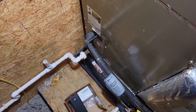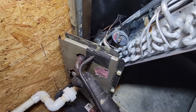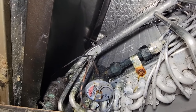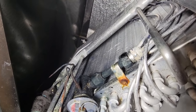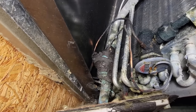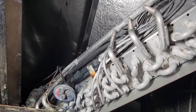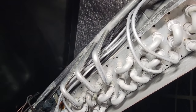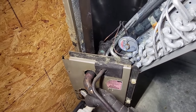They've got a water treatment system that treats it so you can't taste it, but the effects are still there. You can see the TXV is pretty eaten up. Unfortunately they didn't include the coupling piece that goes from the aluminum to the valve — they used a flare valve, which is kind of a poor choice. The copper going into that piece is all corroded and ratty looking. The aluminum isn't doing all that great either — it's kind of white and chalky looking. Not good.